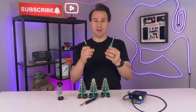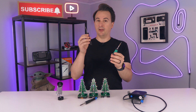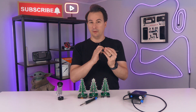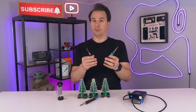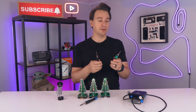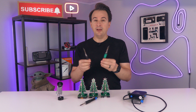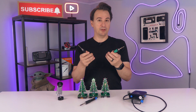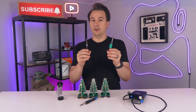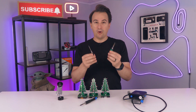You can buy specific caps for these, but that adds to the cost. And speaking of adding to the cost, this is all you get for your $30 and your $80 with the TS-80P soldering iron. So you need to provide your own USB-C cord or barrel jack cable, and you need to provide a power brick of some kind. If you want the fastest heating, you need a good one. I have a GAN charger - it is $45 - and my USB-C cords are like $10, so that was an extra $55 to add to the price. If you already own those things, you don't spend extra. But if you don't, and all you have is a USB-C brick that doesn't do 45-watt charging, your heat-up times are even longer. So sometimes just saying these are cheaper isn't the whole story.